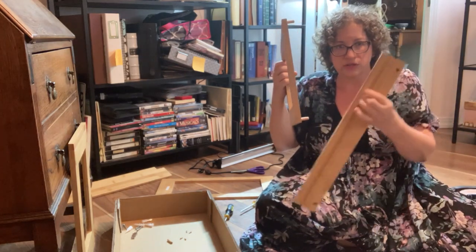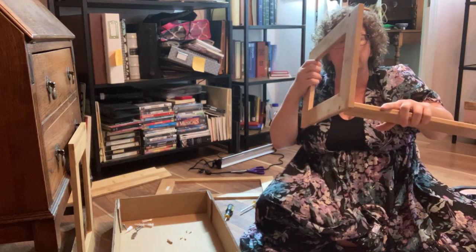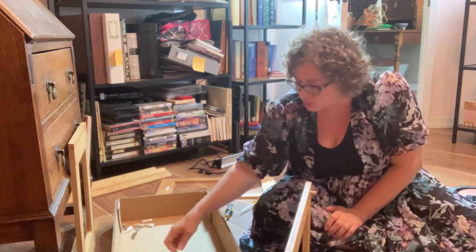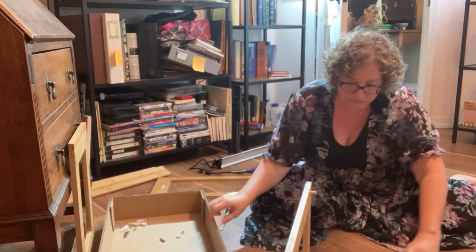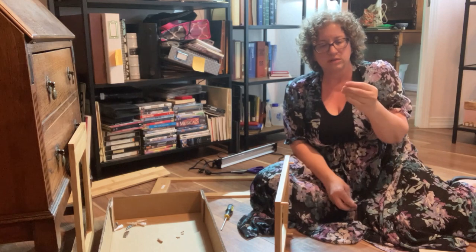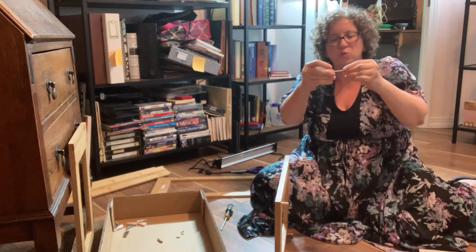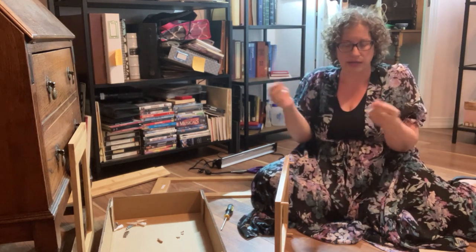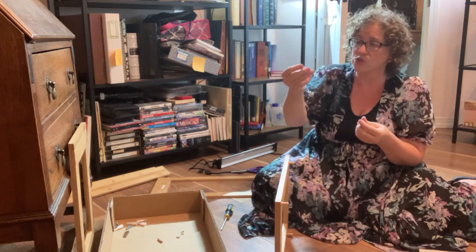Here is the rail, and here's the little place where you're going to slide the frame in. You can only do it one way — you slip it on there with the wooden dowel. You're going to drop one of these cross dowels — it doesn't look anything like a wooden dowel — into the hole so that the large bolt will basically screw into it. It's pretty simple, like putting together furniture from Ikea or Walmart with those cross-dowel pieces. You'll use the hex tool to tighten it.